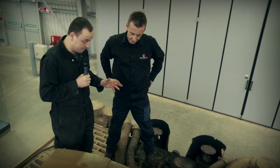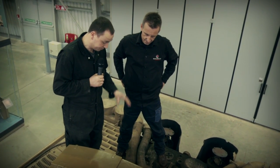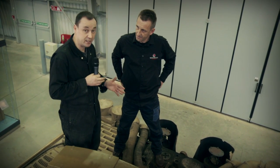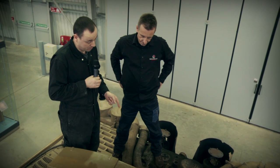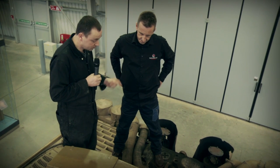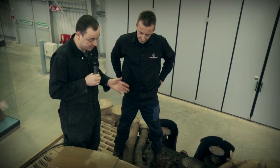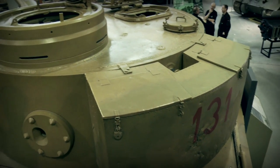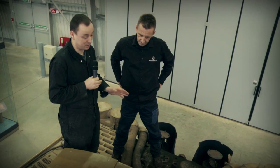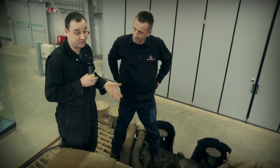The next thing is the main engine oil, which is practically directly underneath me. Because it's a dry sump there's a separate oil tank with a dipstick underneath as well. What we do is pull the dipstick out — if there's oil on the dipstick, it's safe to start — then re-put the dipstick back in. The other thing is just a visual check all around the engine: coolant pipes, petrol pipes, any sort of smells we're not happy about with fuel. Being a petrol-driven engine, you've got to be safety-conscious all the time.